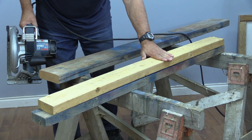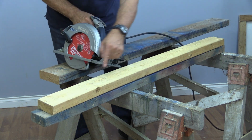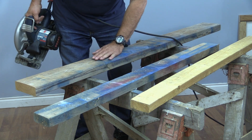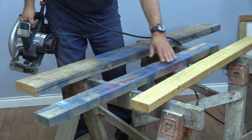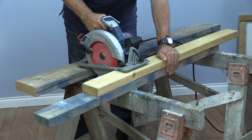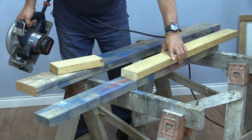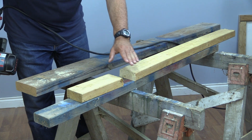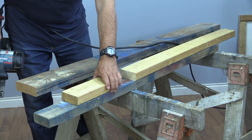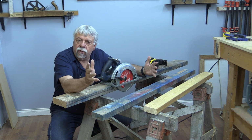For example, if I were going to cut this board here, I would not want this to fall off the end. So I would cut that along here, and that means that that board is supported. Now these pieces of wood that I have on here, you can see there's paint and everything on them. These are just sacrificial pieces of wood. These are fairly new on here, so there's no cuts in these yet, but typically over the years these get cut with all sorts of little things because I'm cutting wood. You're cutting through and you're making little marks like this in the wood because you're supporting that wood. And it's important to do that because if they're just little pieces like this, it would have been fine. But longer pieces, 1.5 feet, 2 feet and longer, you need to support those so that they're not falling off and you're losing control.